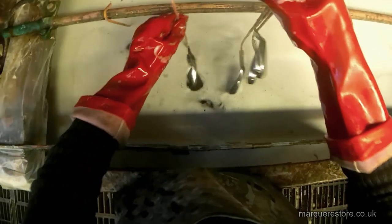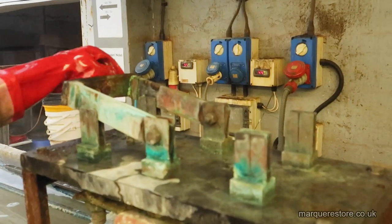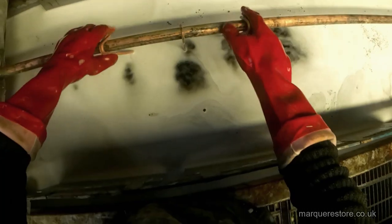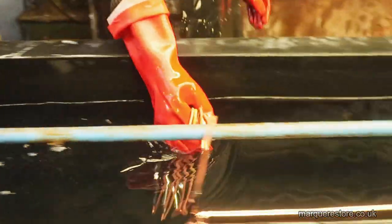Although it's a really dirty job, all the work has to be superbly clean — just being degreased isn't enough. It goes into this tank where we pass an electric current through it. This blasts any oxides off the surface of the metal, leaving it in what's called an active state so that it will accept the plating properly and the plating will adhere to it. Then it goes through a rinse system, from dirtier water to progressively cleaner water.